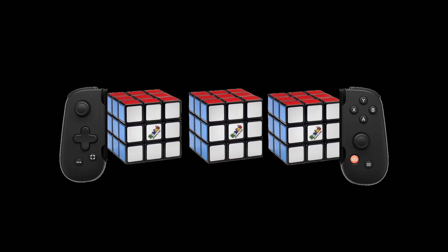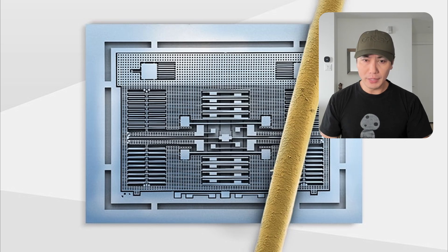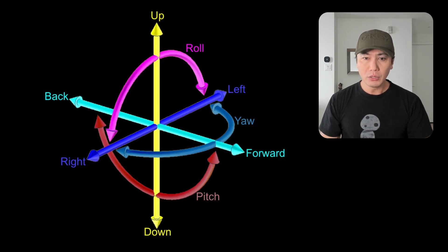To achieve the size that makes it usable in handheld devices, we have to thank the Silicon God for that — the MEMS gyroscope. Our electronic devices use MEMS gyroscopes. MEMS stands for micro electromechanical systems. Any MEMS gyro can be smaller than the width of a human hair — and that also makes them much cheaper. Amazingly, those tiny devices have moving parts, unlike the optical ring laser gyroscope. MEMS gyroscopes are often combined with accelerometers and are known as six-axis gyroscopes or motion sensors.